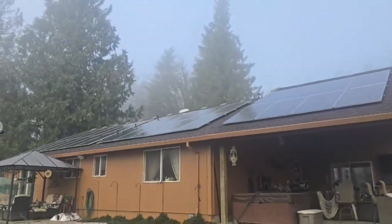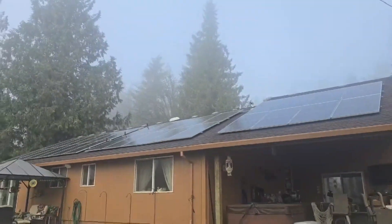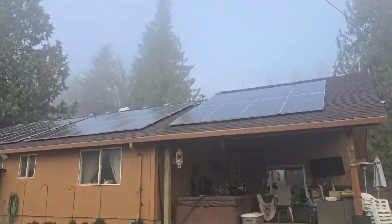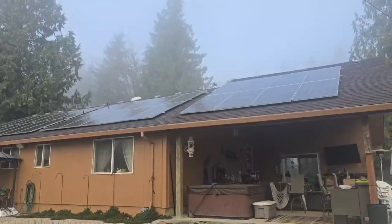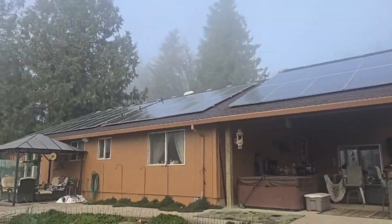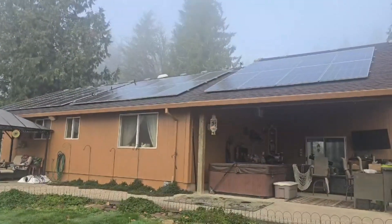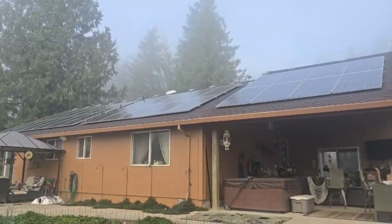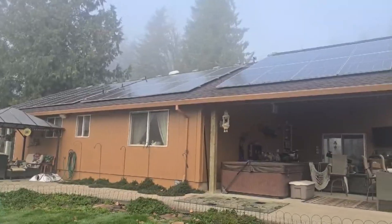In this video we're going to talk about solar systems - things you should think about before you start. Number one, if you can put a solar system up on your roof, have a roofer help you do it so you don't get leaks later on. If you have the option to put panels in your backyard or a big field, I would put them on the ground just because maintenance on the roof is kind of tough.